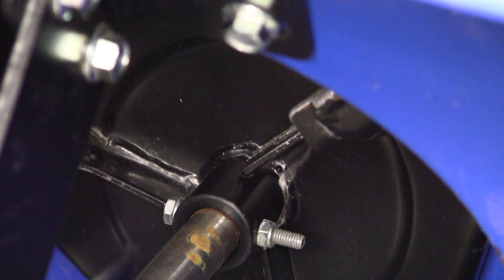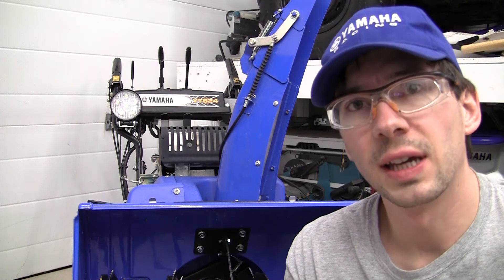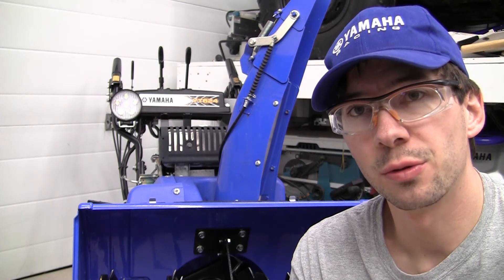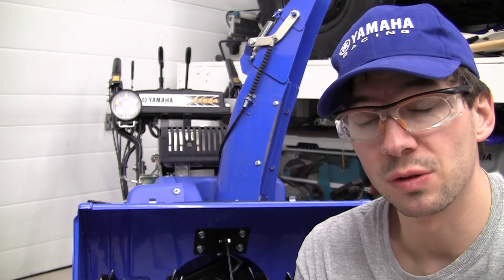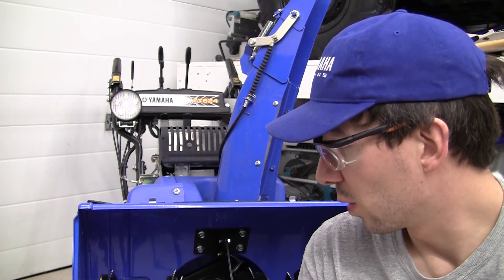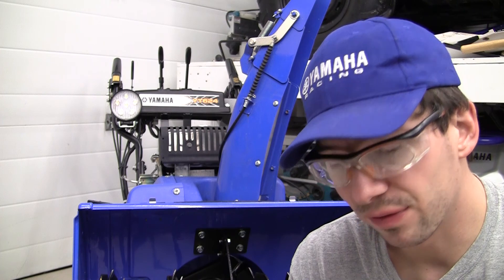One very odd observation: none of the bolts in that shear bolt kit appear to fit the impeller location — that's not what I expected. I'll get that part number and list it in the description below. To summarize: there are five shear bolts total — four auger shear bolts and one impeller shear bolt, which is not included in the standard shear bolt kit. All shear bolt part numbers, kit numbers, and torque values for both bolt types will be in the description. If you like the video, please subscribe and click like — many more coming. Thanks.